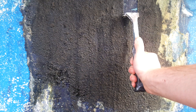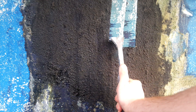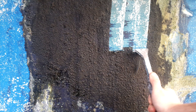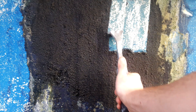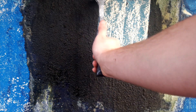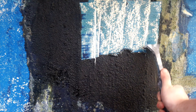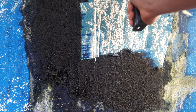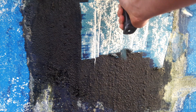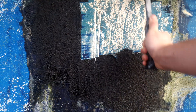And then finally the anti-foul. I know I'm going to be sandblasting the hull now, but this is the only paint I used the original marine strip caustic soda mix on, so I needed to do this in order to have a comparison — was it working or not? For example, if I'd only done the washboards I probably would have thought this was a fail. But as it turns out it worked beautifully in the same way that the expensive marine strip did, and cost me all of about £2.50 to £3, rather than £45 for the two and a half litres. So it was worth the money just to test the small area and see if this will work for you.